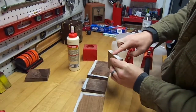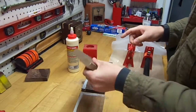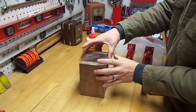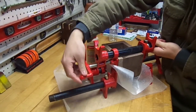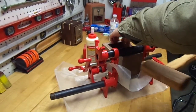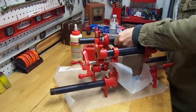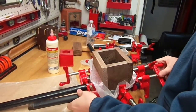In the background of this shot, you can see two banks that I previously made. Hopefully this one will turn out similar to the dark walnut one closest to you. In my previous builds, I have always glued and clamped together with the actual post office door in the box when clamping down — this makes for a tighter fit. I didn't have an extra, so I just clamped without it. I put a piece of wax paper between my pipe clamps and the box itself so that it doesn't adhere to the pipes. I let this sit overnight to make sure it was nice and dry, then I was able to remove the clamps.